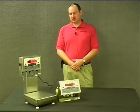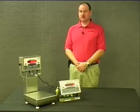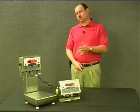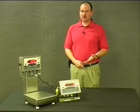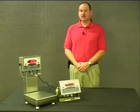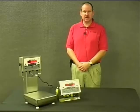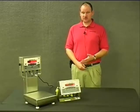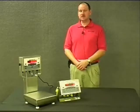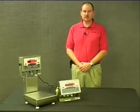The truly exciting thing about both check weighers is that they can be connected to our Revolution software. You can store customizable print formats in the unit, giving you flexibility to work with any kind of printer — barcode, label printer, ticket printer, or tape printer. You can store formats up to 300 characters each. You can also change the streamed output with that software, so if you're streaming information to a PC, you can change what's being sent out of the unit with Revolution software on the fly.